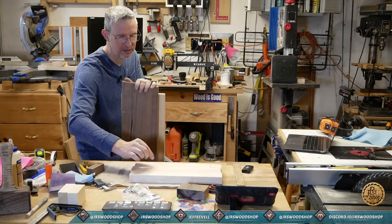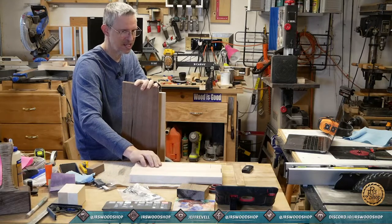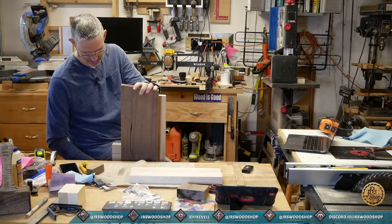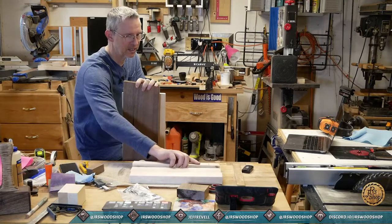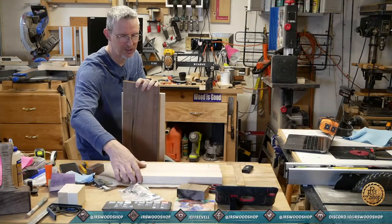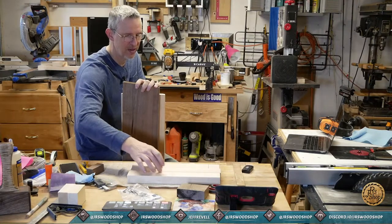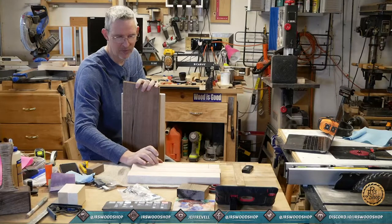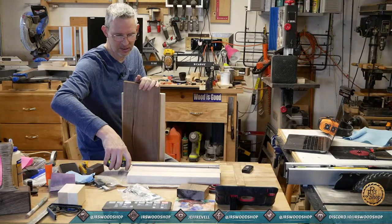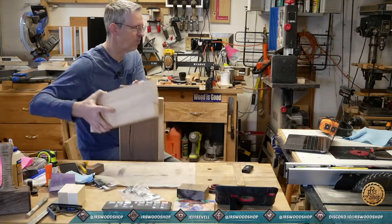I can make some small ones. So I can make some thinner ones that go in there. What's the thickness? These are all the same thickness. And I think these are the same thickness as this. They are. So what I'm going to do is cut some strips that are thinner, because I'm going to get some pattern in here. I don't want just a regular rectangular pattern on here. I want to get these the same width, but then I want some thinner ones. And then we will make the thing out of that. This is 15 inches, I think. So these are 15 inches. So I'll tell you what, let's go ahead and mill up the boards for the walnut one first.